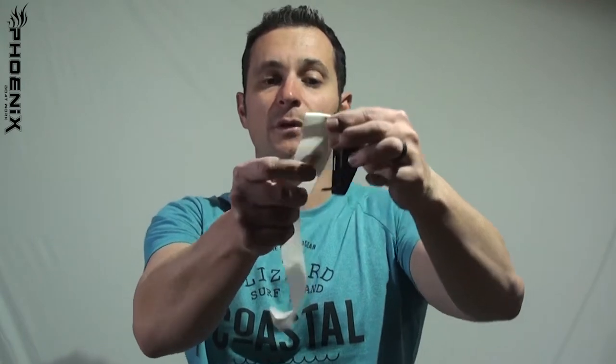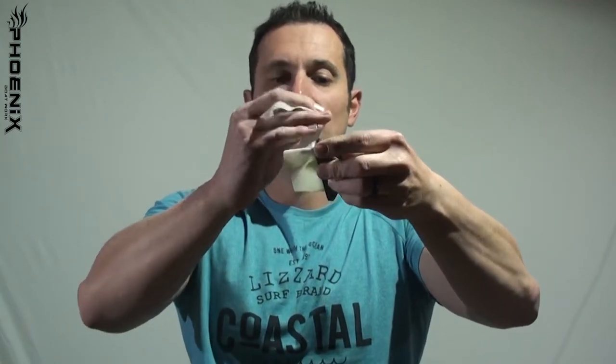When fittings were initially installed, different screws may have been used. If you look at the screws on this cleat, one screw has a different head and thread than the other, which means the thread in the wood would be different. So I leave the screws precisely in where they were — in the fitting — and use masking tape wrapped around to hold them in place so the screws can't fall out and you know exactly which one was in which hole.